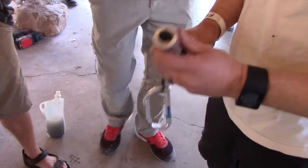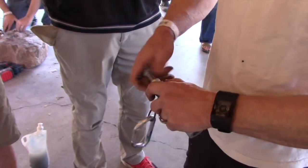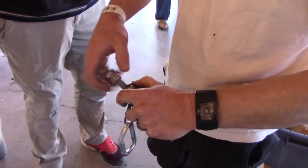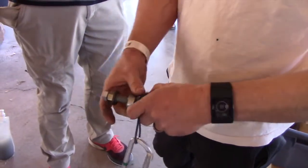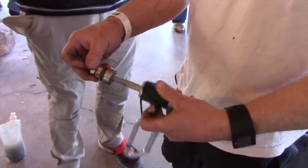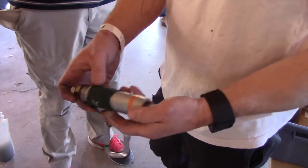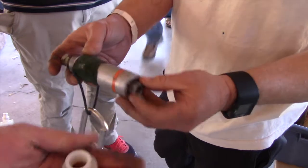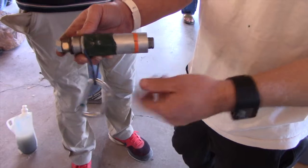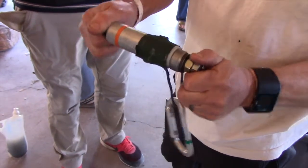So the parts: this is a tap bolt — I think it's a six-inch long tap bolt — that goes into here. Then this is just a regular nut, and then a washer. This is a thrust bearing, so it makes it super easy to turn and it doesn't twist. There's a little plastic collar, and an aluminum tube that you can custom order to whatever length you want — this one happens to be four-inch. This piece I got from Industrial Threaded; it goes on the other end of the tap bolt.